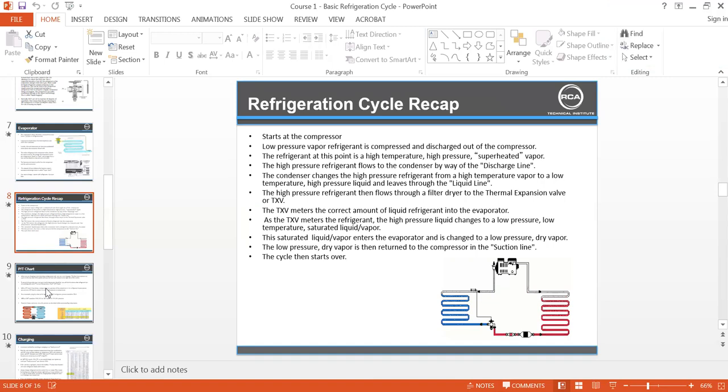He is correct because it will affect it. You may have a longer time reaching temperature because your evaporator and moisture has reached dew point, and you get to a point where you've got a lot of condensate flowing out of your box. But Jim is correct about the superheat setting.